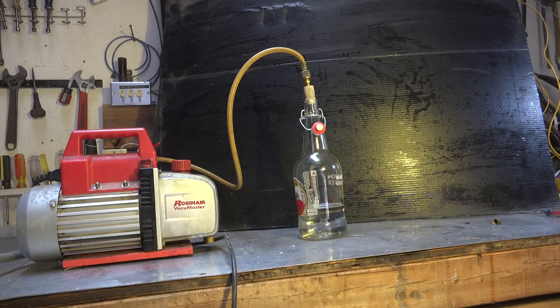I have this odd setup — going to do a little test again. I was asked by someone who commented on my video: if I had refrigerant in a system contaminated with air, could I simply take the liquid out, leave the saturated gas portion, take it into a recovery cylinder with liquid and gas in there, and blow off a bunch of the gas to take the air with it?